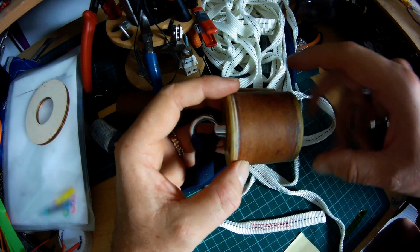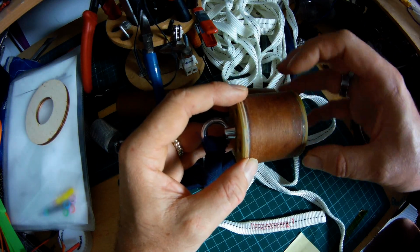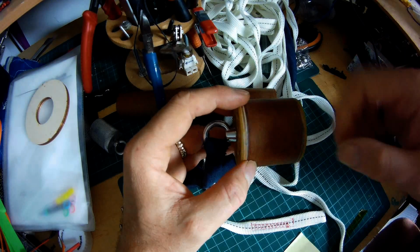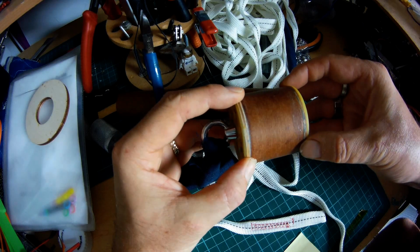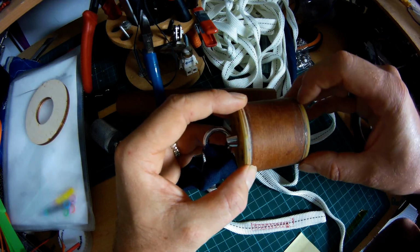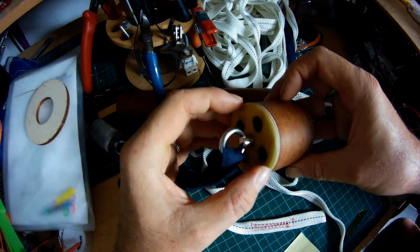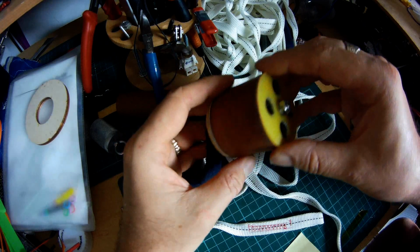It's mainly the baffle plates are made out of plywood. The end plates are thicker, so internally the baffle plates are 3mm ply, given a coat of epoxy resin to make them a bit more fireproof. The end plates, these more bulkhead ones, are more structural, so they're 8mm of ply with 2mm of G10 that's been keyed and epoxied.